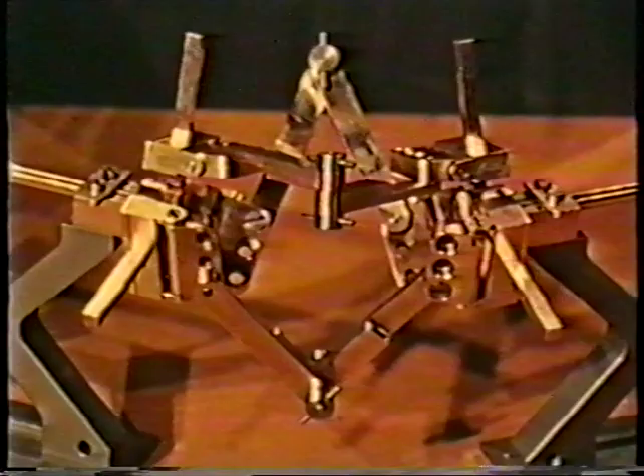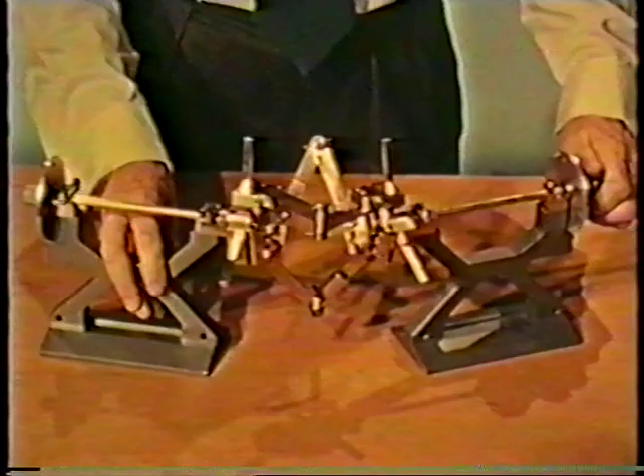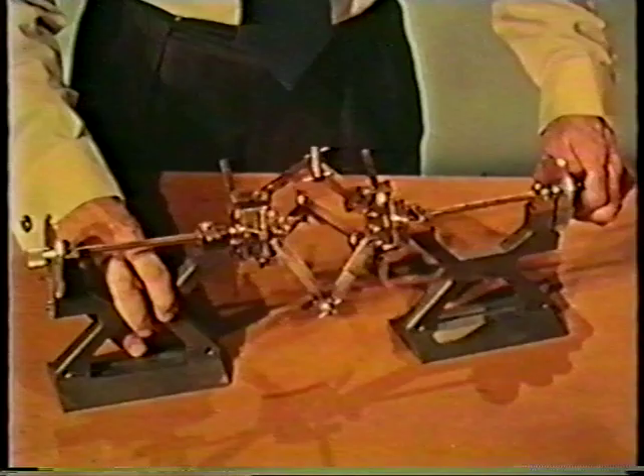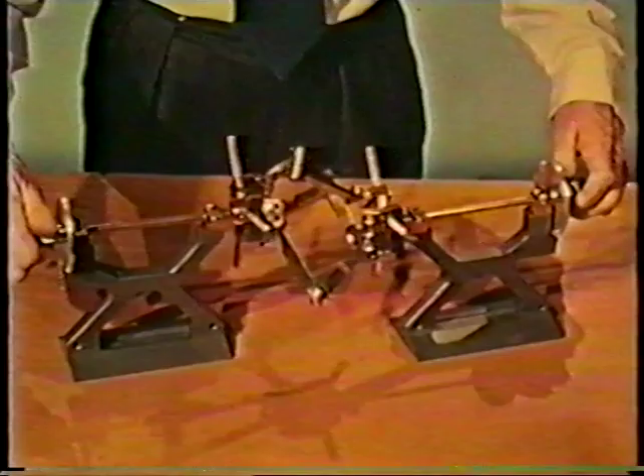It's tripled up and transmits uniform speed between angled shafts, as expected. But, as it turns out, the theory has been stretched too far. Look what happens when the shafts are in line: the coupling is now quite unable to constrain them to intersect at the geometrical centre — it has all become slack. The shafts can freely move apart, parallel with one another, and when they are apart, the coupling works between parallel shafts, again transmitting a uniform speed ratio. The coupling then maintains the shafts parallel to one another, while still allowing plunging.